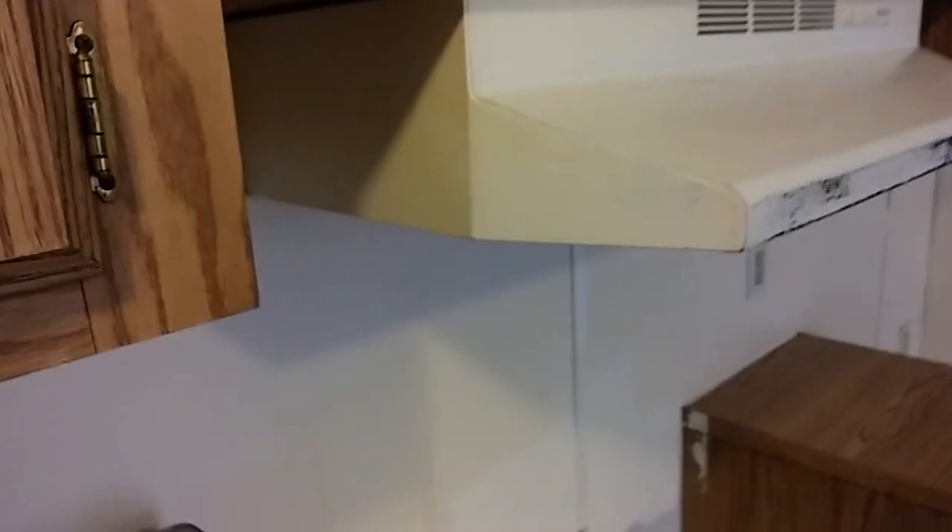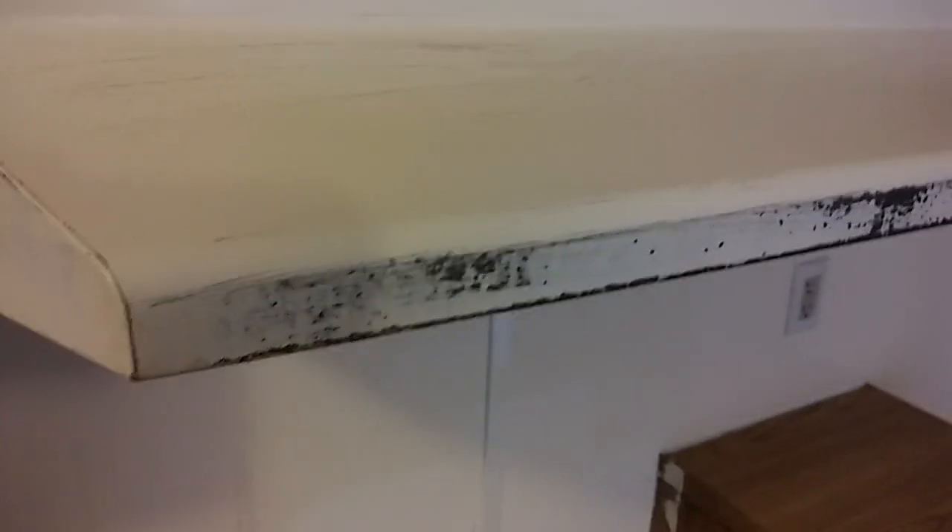The first thing to do would be to sand down any rough areas, any areas that have chipped paint. It's right over a stove, so of course you're going to have grease splatters throughout the entire thing. Pretty much just sand it down — all lumps, all grease, all stains, all chipped paint. If there's any grease or residue, once you spray your epoxy it's going to start bubbling. Just make sure you get every little piece you can off.